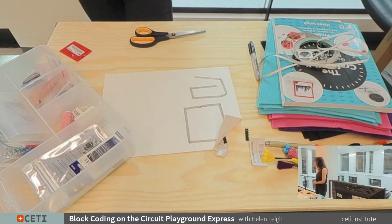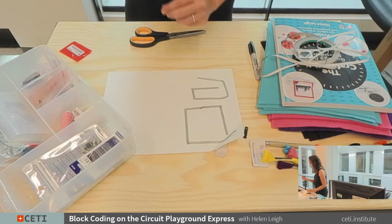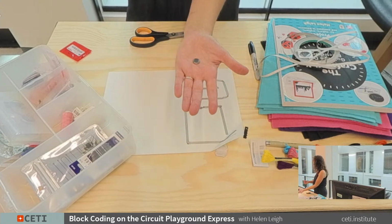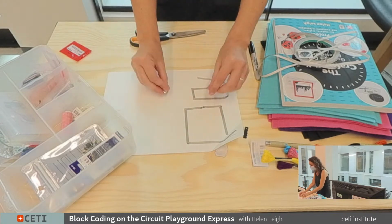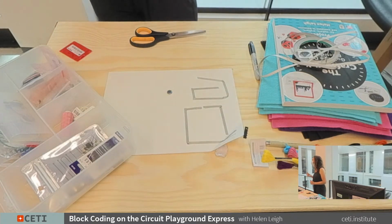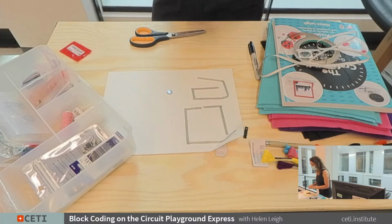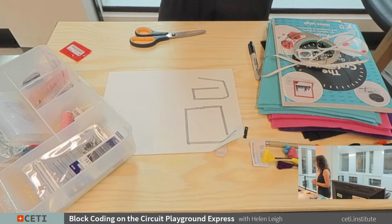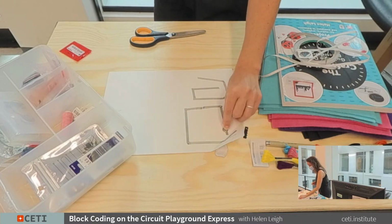It needs to remember, if you look at your coin cell battery, you've got one side that's smooth with writing on it. It's got a little plus, right? That means it's positive. The other side of your little battery has got bumps on it. That's the negative side. And if you look at your tiny LED sequin, you'll also see a positive and a negative side on it. Now remember, electricity is lazy, so make sure that it goes on the path correctly, and also that your connection is good. You might need to push down on it to start with. And remember that the LED needs to go the correct way around. So the positive of the battery needs to be linked to the positive of the LED and vice versa.